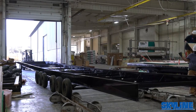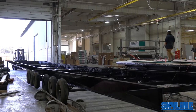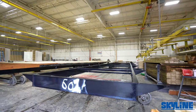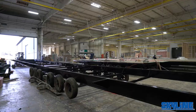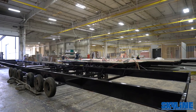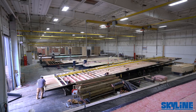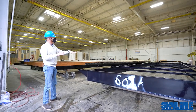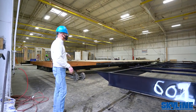We've built all of our own chassis here in the plant. You can see the outriggers — foundation ready. You can see the camber to the frame, which is basically designed to set and hold the load of the floor plan, whether that be a heavy kitchen or bathroom. After that's set up, it rolls into the next station.